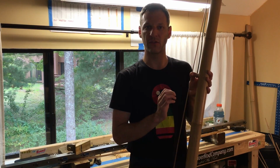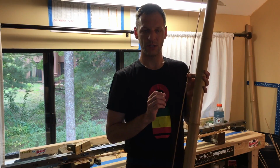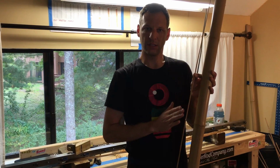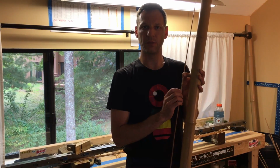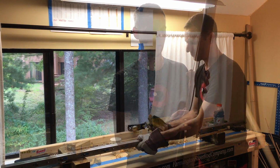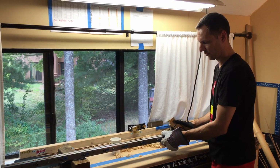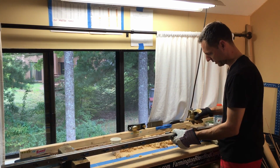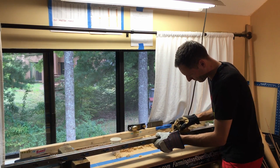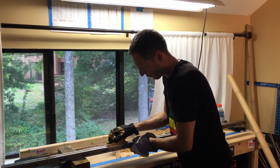Getting close to the final spec now, and we're measuring to the 1,000th of an inch. So I need to remove the enamel layer to get this side completely flat, so that all sides will be completely flat, forming my equilateral triangles of each strip. With the strips in the form, it's elevated above the surface a little bit. I've got a plane, I have a scraper plane. Just start scraping that outer enamel layer off.